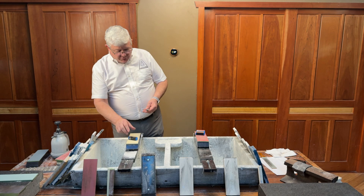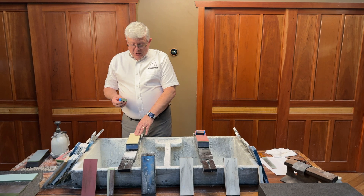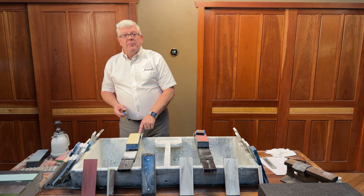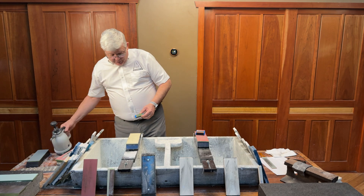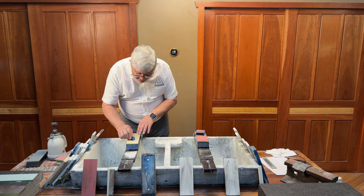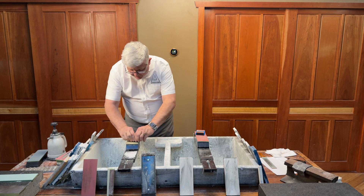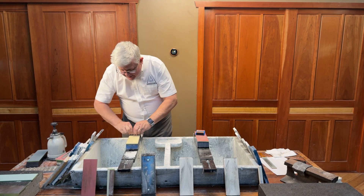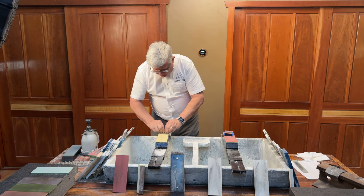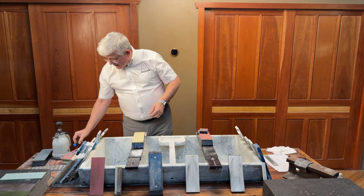Let's talk about how to use the groomers. This particular plate here is kind of dirty — this is a one micron diamond resin plate. I'm going to put a little bit of water on top of it, take the 50 micron groomer here to begin with, and initially clean it because it's a bigger diamond and it will clean the metal out a lot faster. I'm just going around in little circles and working the surface.